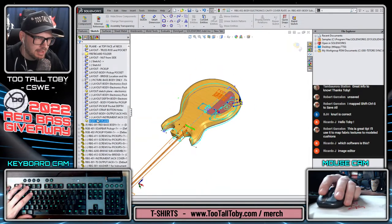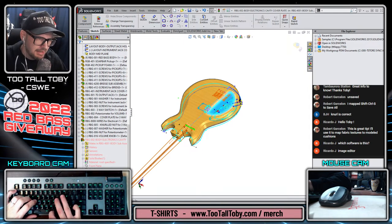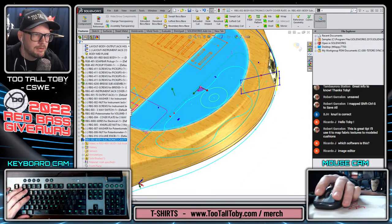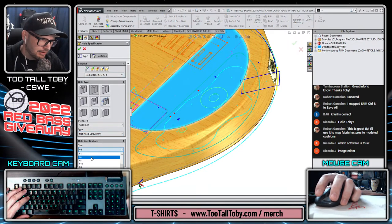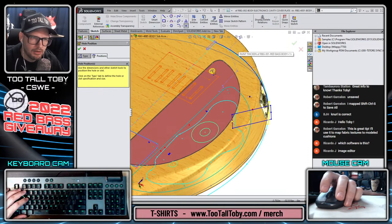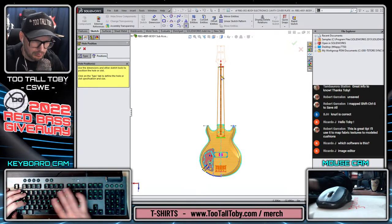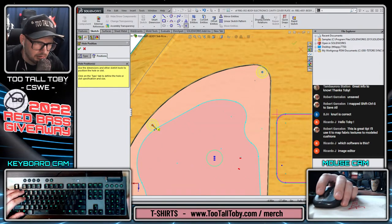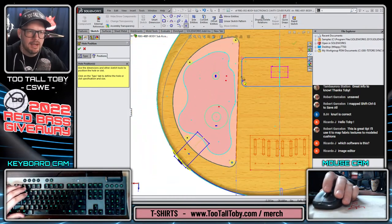Okay, so then this would be called the cavity cover main body, and then I would select that face and then go to features, hole wizard, and I would create some countersinks that are going into there. These are probably for number six. I gotta go look at the physical part. I got it over on my workbench right now, so I'll come back in a second. So it'll be here, and then this is gonna line up with these 1, 2, 3, 4 mounting holes that we put into that master model layout.